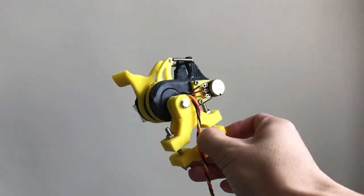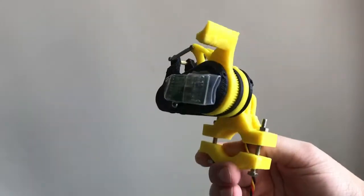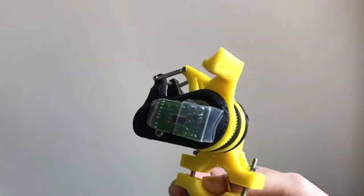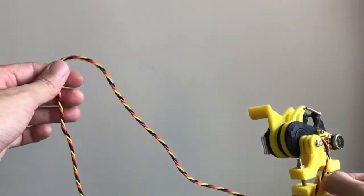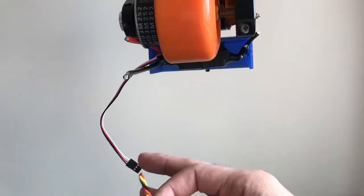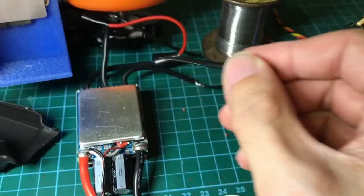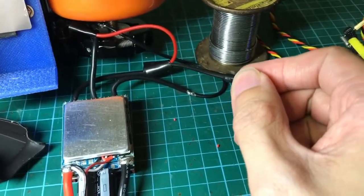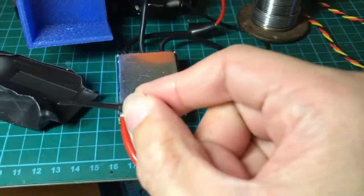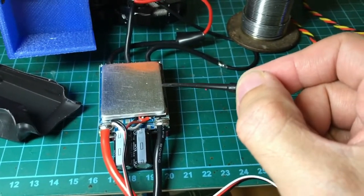The lever throttle control system is pretty much done. As you can see here, the wires to the potentiometer are all wired up, and on the other side you can see the servo tester board is protected in heat shrink to prevent any short circuit. The other end of this servo cable will hook up to the servo lead of the ESC. In this shot you can see I have hooked up the ESC wires temporarily to the motor wires and I am using black insulator tape to prevent any short circuit between the 3 wires. Here I have the ESC heat shrink removed because the ESC was not working — I could not arm the ESC and there was no beeping. I thought I got a dead ESC.